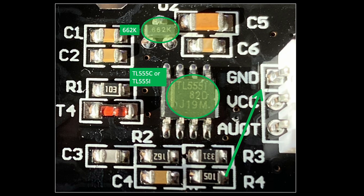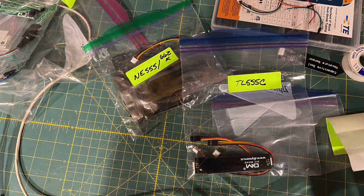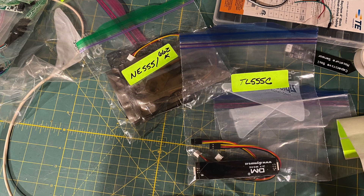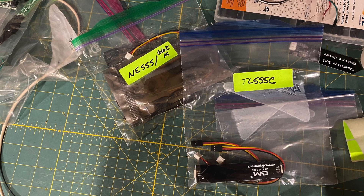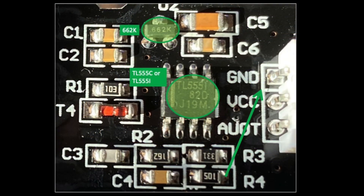These issues can interfere with sensor response and signal range, especially if you're interested in running your setup on 3V, as was my intention for low-power deployments. I had already purchased a few batches of these sensors on eBay and confirmed the same. Of the 20 or so sensors I had on hand, only 4 met the hardware quality criteria summarized on Flora's channel, as shown in green on this slide.